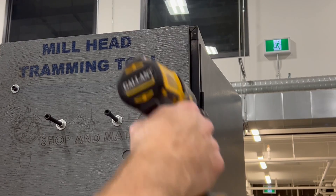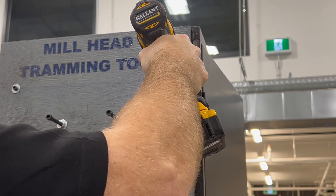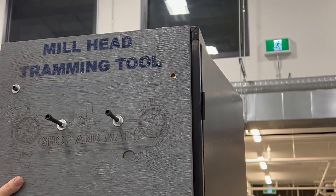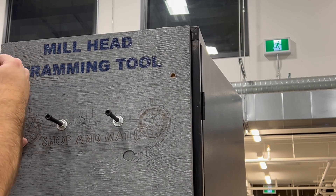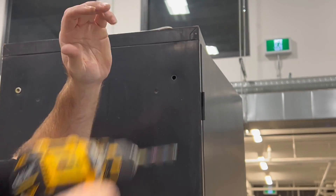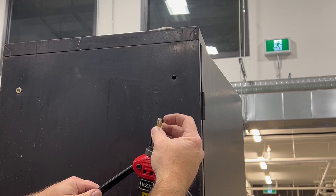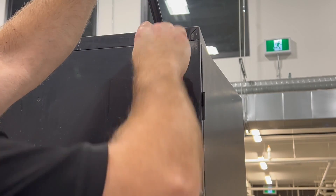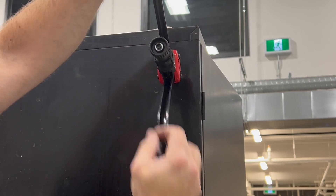Let's try this one more time. I'll go right about here, kind of parallel to there. So I used this as my pilot. Now I'm going to take this down and I'm going to finish drilling the hole, because I can't put the nut rivet in with this piece of wood there anyway. We still have our unit set up. We want to put our nut rivet all the way to the end. Put this into the hole, make sure that we're square, give it a bit of a squeeze, tighten our nut rivet up here, give it more of a squeeze. And that's it — that's all there is.